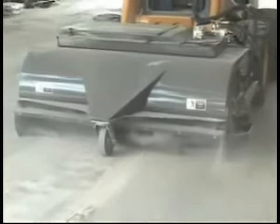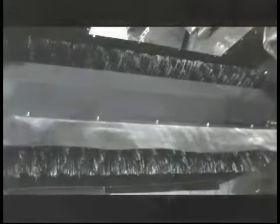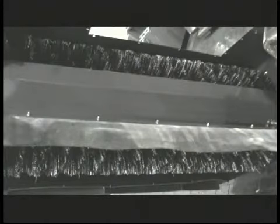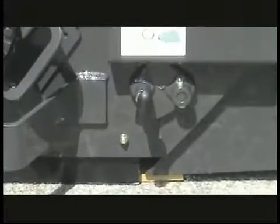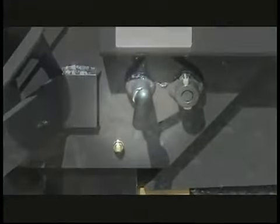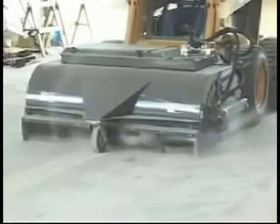The VRS and VS Sweepers are equipped with many unique functions to make sweeping better and maintenance easier. The sweepers feature a unique volumizing feature that matches up close to the brush and increases the ability and amount of material that can be put into the sweeping hopper. An easy adjustment handle loosens the volumizer and allows you to adjust it so it stays close to the brush as the brush wears. The volumizer is removable for sweeping in a rearward direction and can be used or not used according to the customer's requirements.